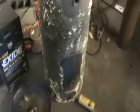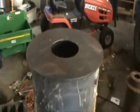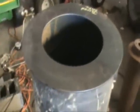I'm going to plug up that hole - I may use it as an out port. Those holes on the bottom I'm going to plug up; I may just cut those off and then weld them. As you can see, there's the top where all of the parts came out. I had a local steel place cut me these plates. They're 3/16 inch steel, the same diameter on the outside - I think it's 18 inches.